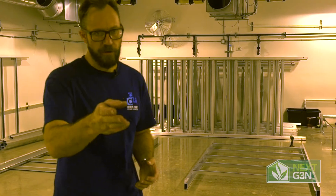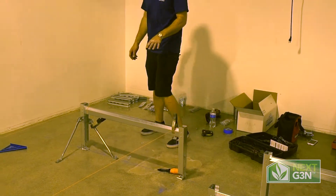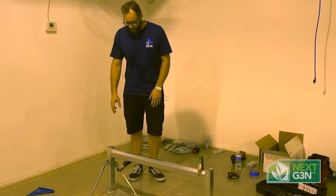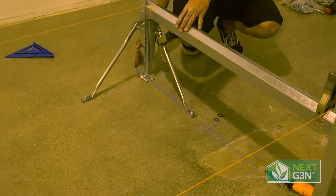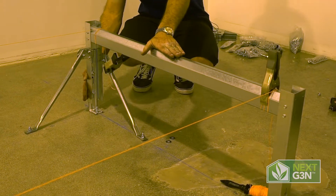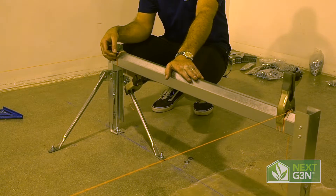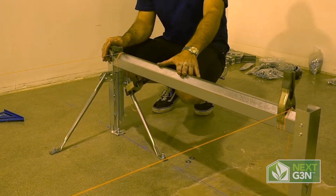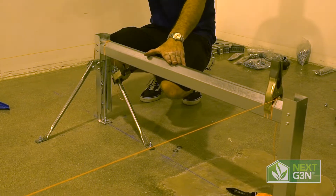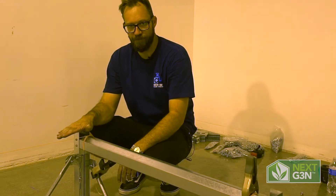We're going to start up here at the top end of the room. This leg here has already been set and leveled. What we've done is lifted the leg up, secured the hardware on the side, and leveled the top and the face. With our struts in place, we've strung all the way down our run to the other leg. The bottom leg at the end of the room has also been leveled using the same procedure. This allows us to set our fall.